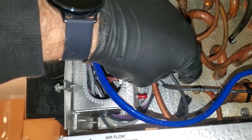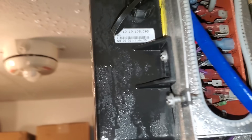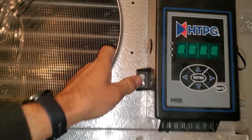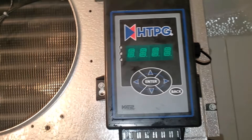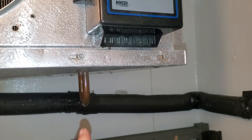Making a pretty educated guess here, but I have the software, so when I get it all done and fixed, we'll pull it up, analyze the history, and I'm pretty confident we'll show bad coil sensors. We also had a cracked fan blade — we're changing that too. I got the sensors put back in the evaporator and the suction line — I still got to wrap it with tape. The air temperature sensor is wired into the coil. I'm going to be able to access the coil via the Ethernet port right here and plug in the Wi-Fi service tool to access the controller parameters from my tablet. My fan motors and insulation are coming back.